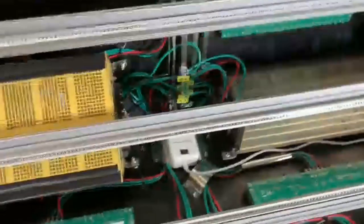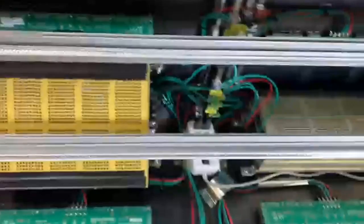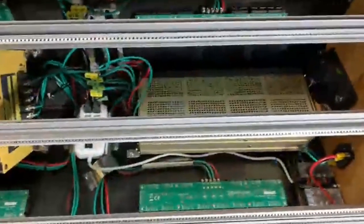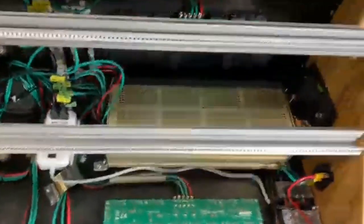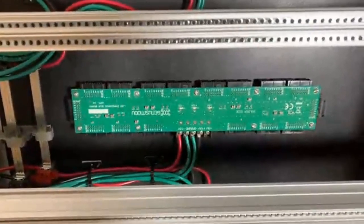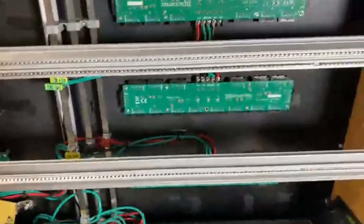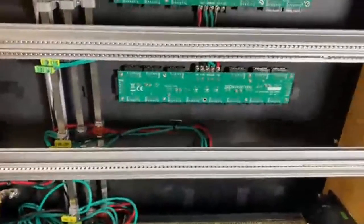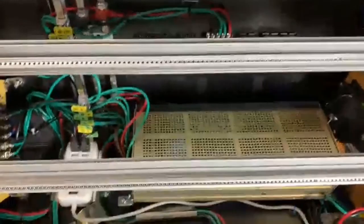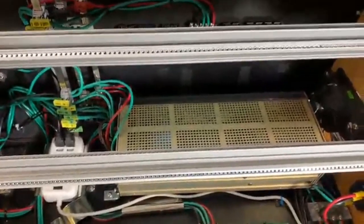And I tried some other power supplies in here before. I had some Bel Power 1 supplies in here. They're excellent power supplies, but I had some startup problems with the case where all the capacitors that are on these individual bus boards to cut the noise down, and all the capacitors that are in some of my modules to cut their own noise down, required a huge surge of current, like an additional couple of amps on power up. And the power supplies are going, this is too much, I'm out of here.